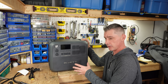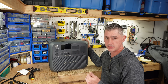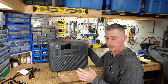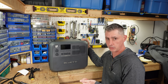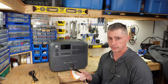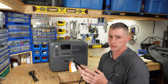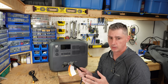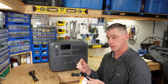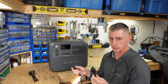There are actually four different ways to charge this unit. First, there's your traditional AC charging — you can actually do 2400 watts of AC charging. For that, you're going to need to buy the additional twist lock cable because it's thick enough to handle the current. The cable that comes with the unit itself only has 14 gauge wire inside the sleeve, so you're only going to want to do a max of 12 amps at 120 volts, which is 1440 watts going into the unit. But if you buy the optional cable with the twist lock connection, then you can do 2400 watts of charging.